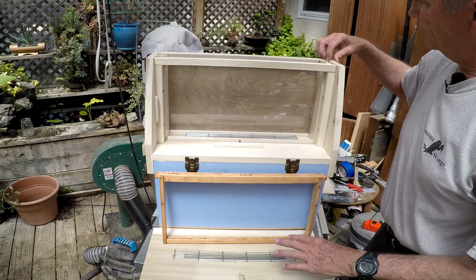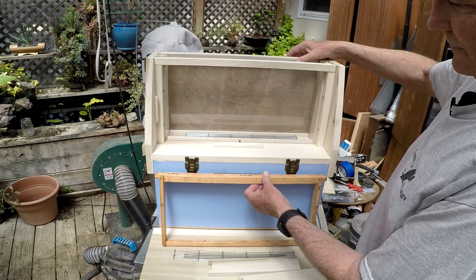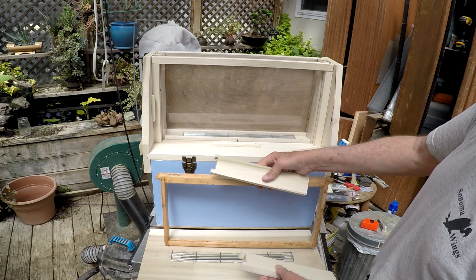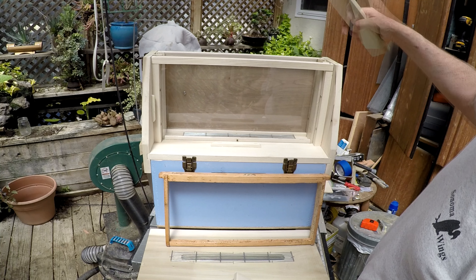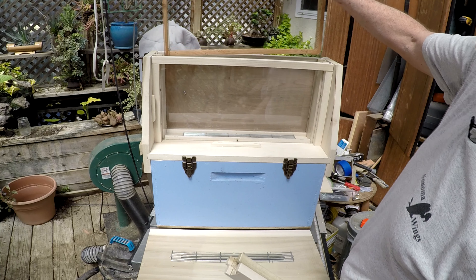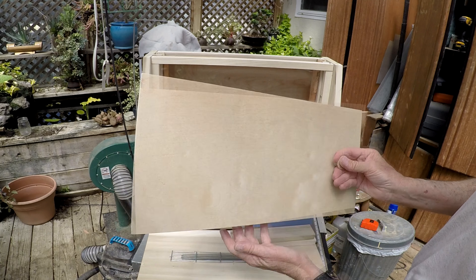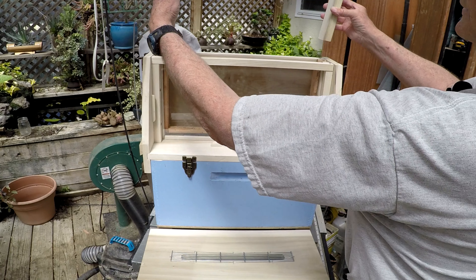There's also a quarter-inch piece of plywood on the end — you can kind of see it here. Everything is made out of three-quarter inch wood, but if you place this piece over here it's not long enough to support the frame, so you need an extra quarter inch for the frame to sit in. You can get that piece out of the plywood you'll need to cut for the face cover anyway.